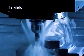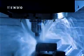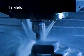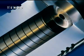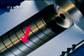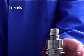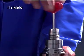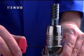The system is completely closed, preventing contaminant intrusion from coolants, lubricants or chips. Tendo is absolutely maintenance free. Tendo Groove provides a path for oil, grease or coolants to exit during the clamping process, keeping the surface between the tool and the holder dry and clean. Tendo hydraulic tool holders are available with a precise axial length adjustment and with a precise radial length adjustment as an option.